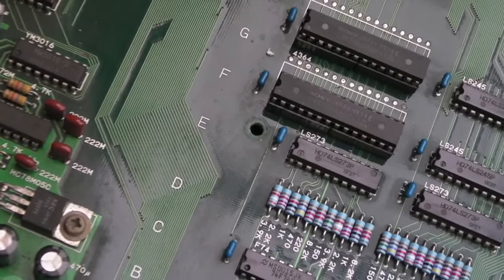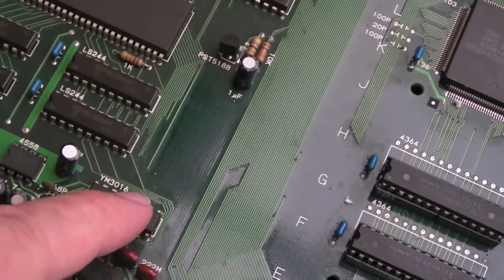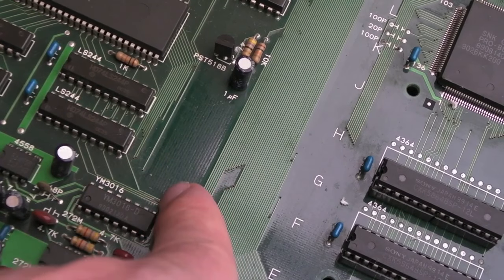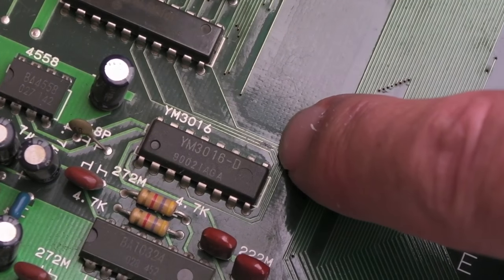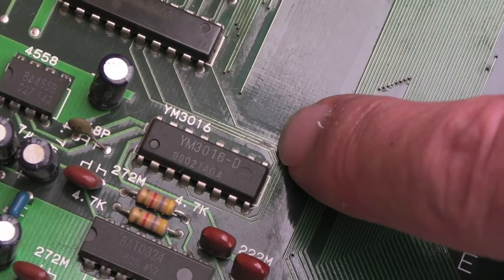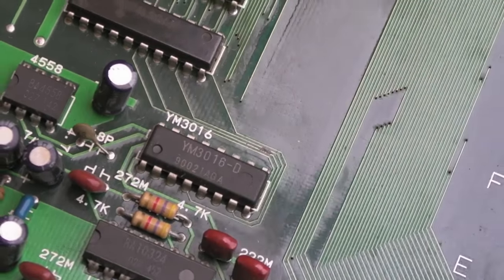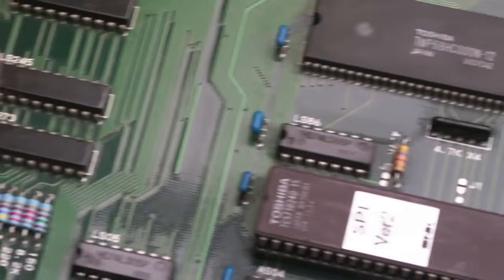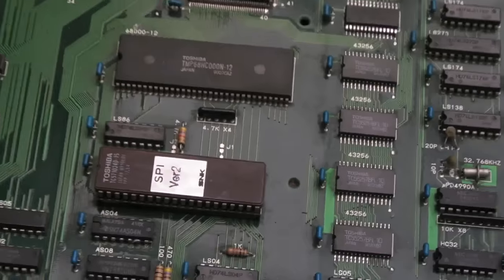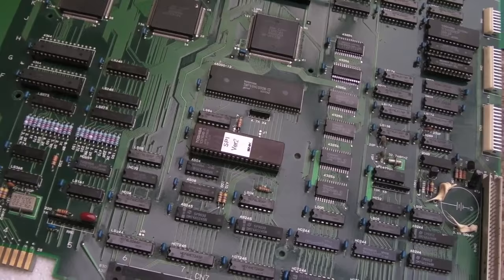Can you see here we've got like a bit of corrosion on there, maybe a burnt out trace going to the 3016? Or something around the sound circuitry there. That's the sort of thing you only spot when you clean off all the surface contaminants. So there are just two or three points like that I've spotted and thought, 'ah okay, could be a problem there.'